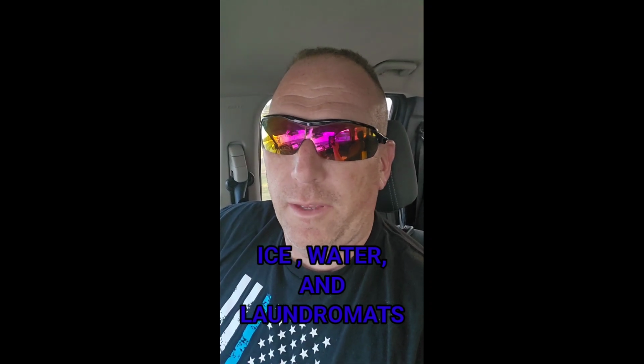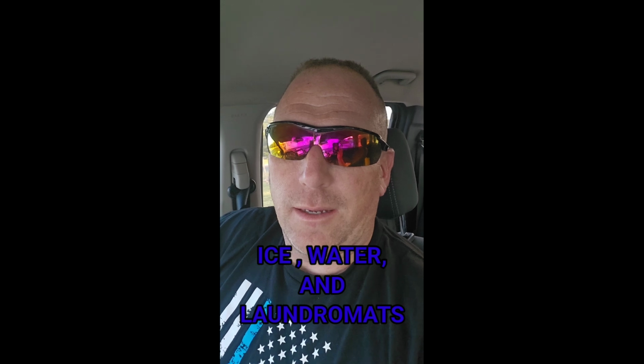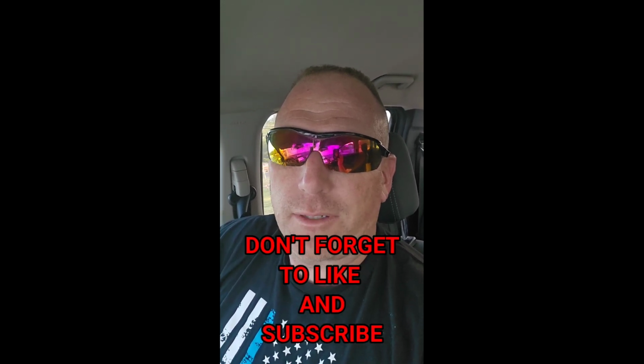Hey guys, well, this is the joy of ownership here. Having to drive about 25 minutes down to your machine after a 10-hour shift because you have a dollar bill jam. Basically, it's where somebody has jammed a dollar bill in the machine. It wouldn't take it. They pushed it back in, went back and forth a few times, and then they just stuck their finger down there so the bill couldn't come out. And then, like, that's going to force it. So then it just crinkles the bill up, blocks the whole bill validator, and takes it out of service.